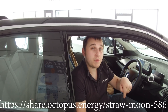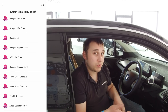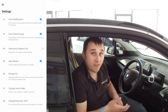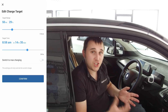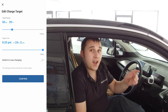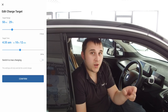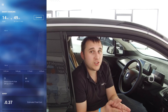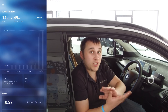If you want to join Octopus there's a link in the description — you get £50 if you join. There are two tariffs: Octopus Go, which I've done a video on before, and Agile Octopus. Agile is better for people with multiple EVs or Teslas who don't want to be restricted to charging only at night. Agile Octopus prices change every half hour. This cable will optimise to charge only when electricity is cheap — it looks at the Agile tariff, sees a period where electricity is 2p or 8p, or where you'd be paid to charge, and charges in those periods. You tell the cable when you need the charge by and what time, and it looks across all slots to ensure you get that charge done at the cheapest rate.